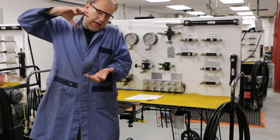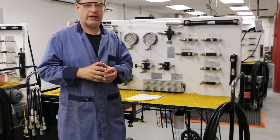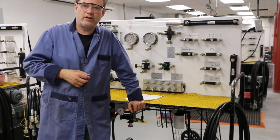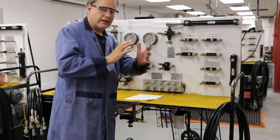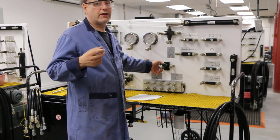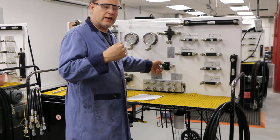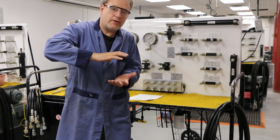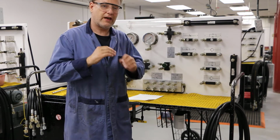The application here that we have for this lab is that we've got a press that's going on, we've got a mold, and it's being clamped together. Now, when I clamp my mold together, I want it to clamp at 350 psi, because that will create a particular amount of force that's clamping my mold shut. But my system runs at 500. So if I'm running a system on 500 psi, but I only want 350 during the clamping process, then I can use a pressure reducing valve, because once the pressure gets to 350, and we know that during extension, the pressure is low, so it will still extend. But when it gets to the end, when it's actually physically feeling the back force of the mold being clamped down, the pressure rises. The pressure goes up and up and up, and then it reaches 350, the set point, and then the flow to that cylinder will stop.